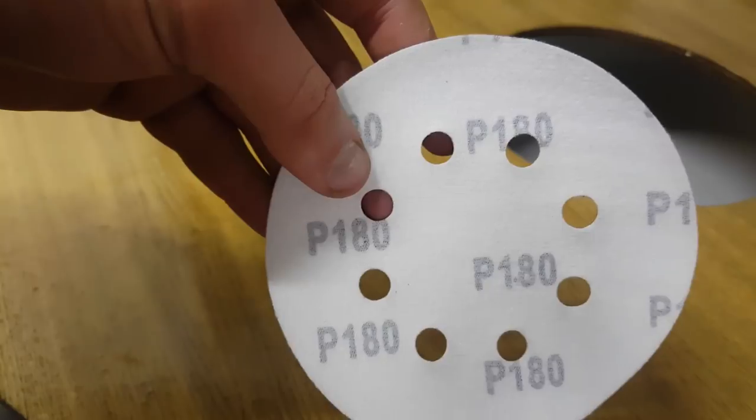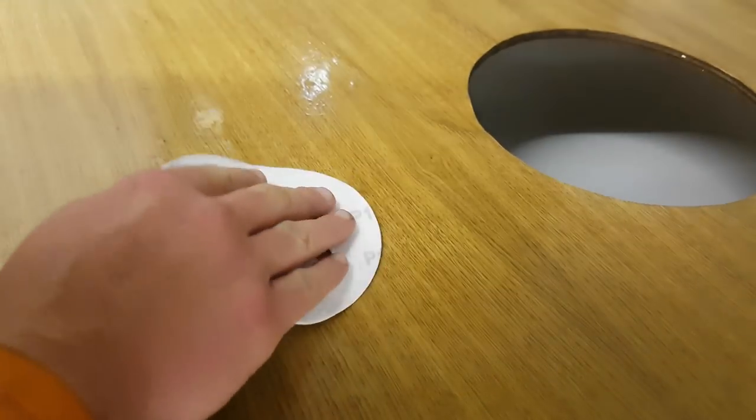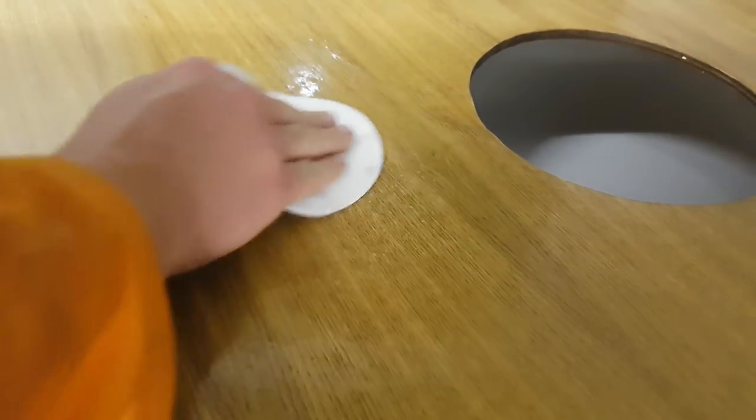So now an update for the panels for the V-berth. The epoxy was fully cured. I keyed the surface with 180 grit sandpaper, wiped it down, gave it a coat of varnish, left it overnight for 12 or 13 hours in a heated room. But then I didn't have access to that heated room for any further coats. So for the second coat, I had to take the panels, put them in a cabin outside, which is basically like doing it in a garage. It's just cold. I then gave it a second coat.